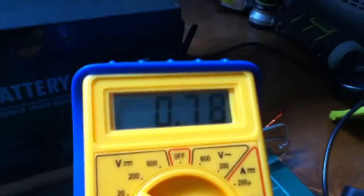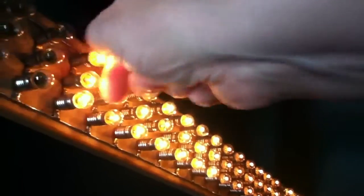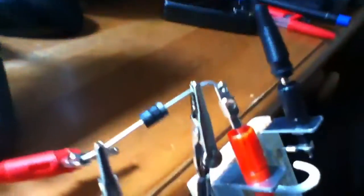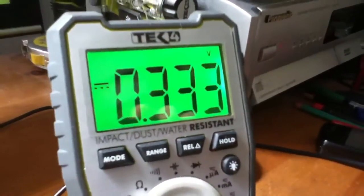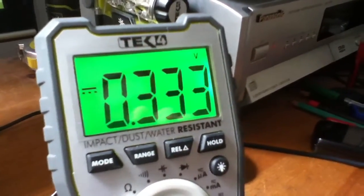Let's have a look at what we've got on the sinometer. So that's 0.78 of an amp — let's keep going a bit and get one amp. 1.05A — so we've got 1 amp flowing through that diode, and we're now reading 330 millivolts, 0.33 volts forward drop.